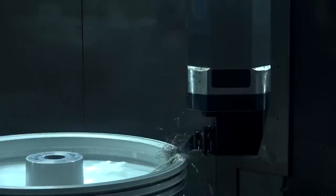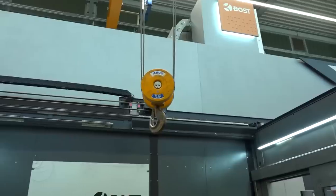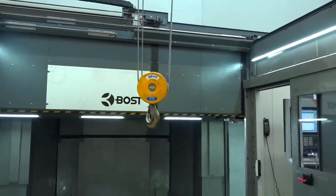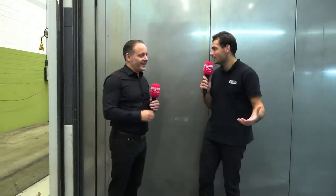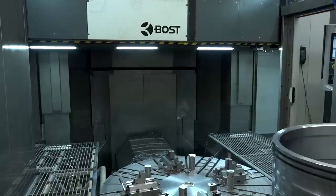But what are the difficulties in making big parts like this? You know, always when you have big parts, one of the first things is to bring the parts in. As you can see, the design of the machine — everything is open right now. So the operator, Hoover in this case, with the crane, can bring the part in. We have this Y-axis to bring the part up in front. Loading and unloading is really no problem with this machine design. With these big parts, it's part handling — you need to think about how you're bringing the parts in, especially when you've got a workshop that can barely contain the size of this machine. You've got to get them around, somehow fit them through with fork trucks. So it's really important to make it as easy for the operators as possible.